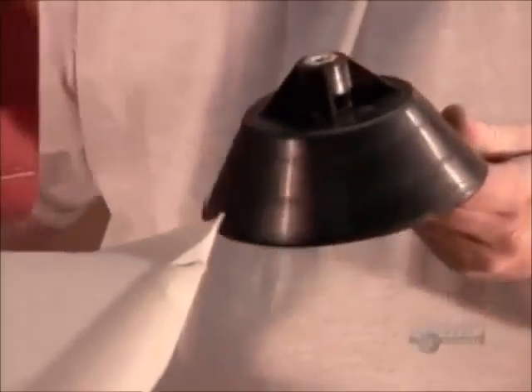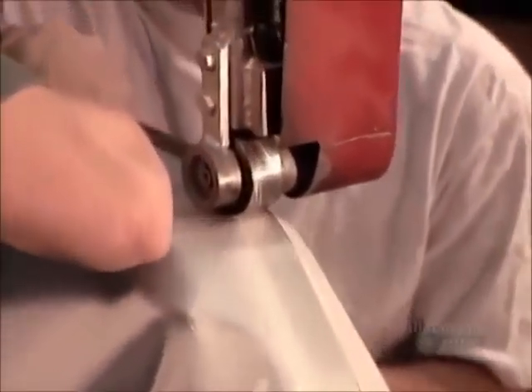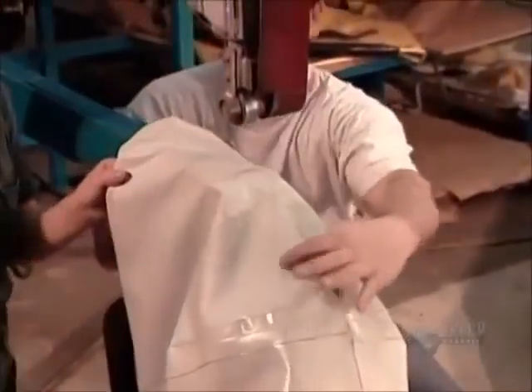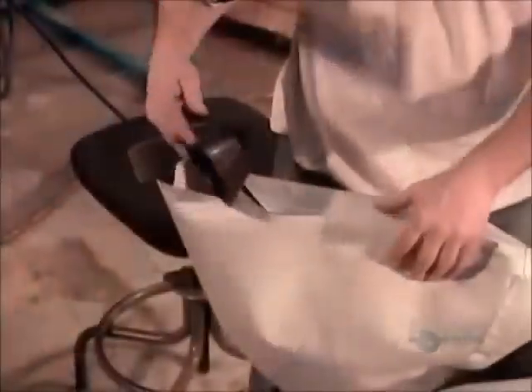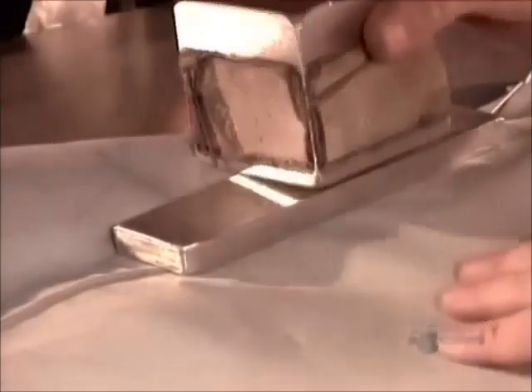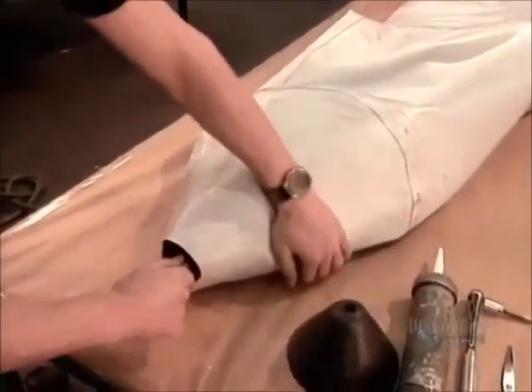Next come the cones. Cones support the weight of the motor and enable the boat to plane — to rise above the water when traveling at high speed. Using the propane flame machine, workers seal together the ends of the boat, then insert the inside cone piece just before they close it up completely. They finish off the seal using the high-frequency welding machine, then pull the cone piece through.